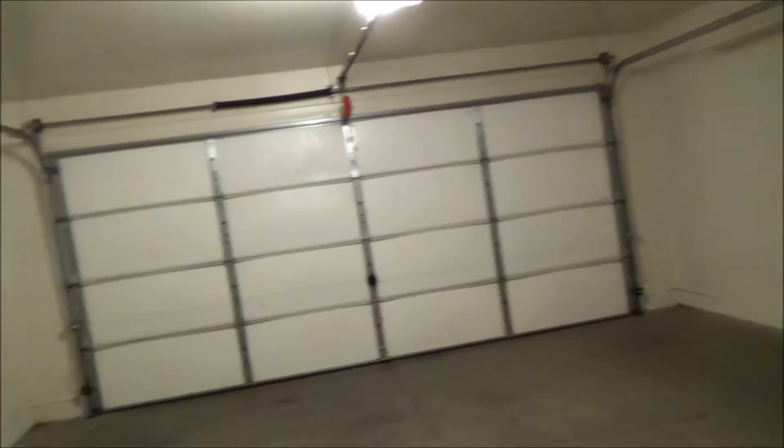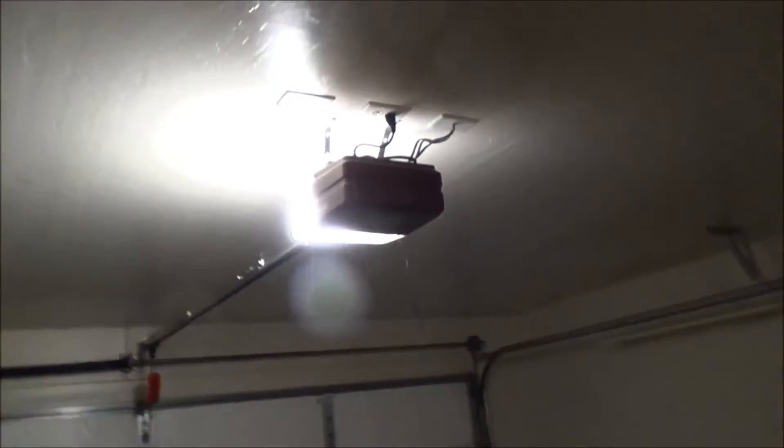And then the garage door — I've got to do some explaining here, Keola. This was one of those things where I didn't know where to stop in terms of the repair. The bins just said to put a spring on there, but the garage door opener wasn't working properly, I think from the weight of the door with no spring. The gear shaft assembly in this thing was out of alignment — I had to take it apart and basically rebuild it so it worked properly.